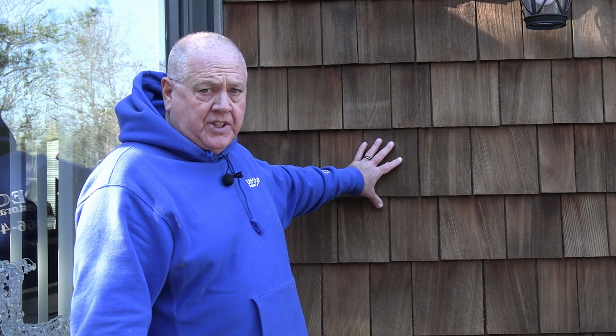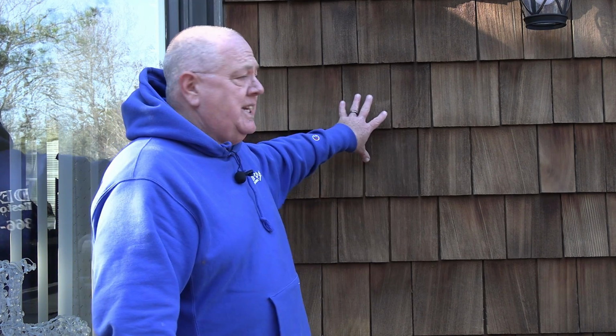What we do is we're going to put a 4 or 5 year maintenance plan together that's going to be discounted, because in the future we don't have to restore the wood like we did using different products and chemicals this time. We'll actually just do a cleaning, and the cleaning is going to involve 3 or 4 different types of products that we're going to use. We'll go over in a minute, but the process is simple: a light clean on all the surfaces, and then you have to evaluate what you're going to do as far as the coatings. We're going to do 1 coat or 2 coats.